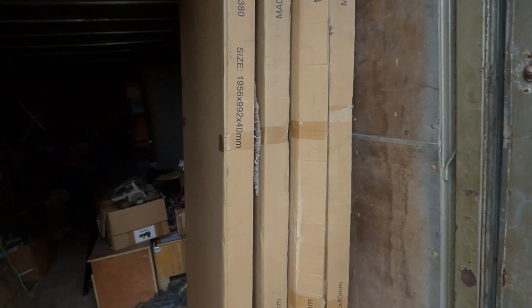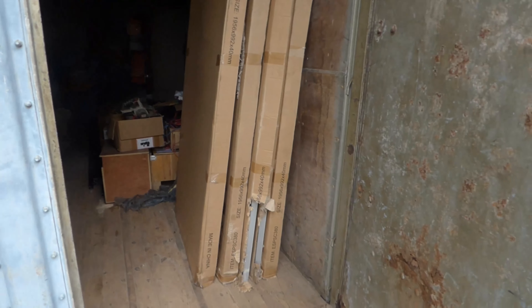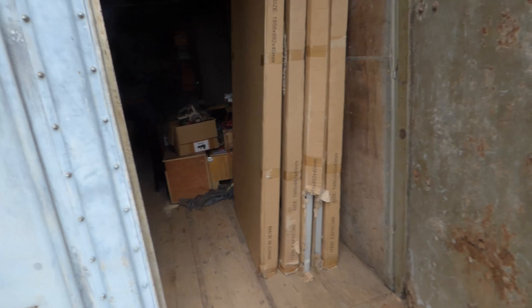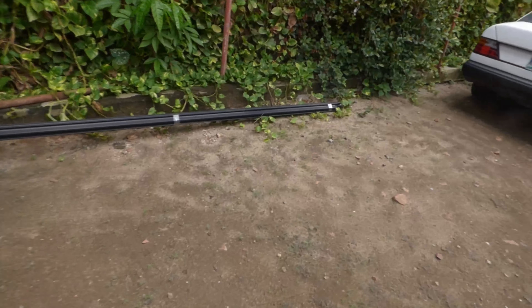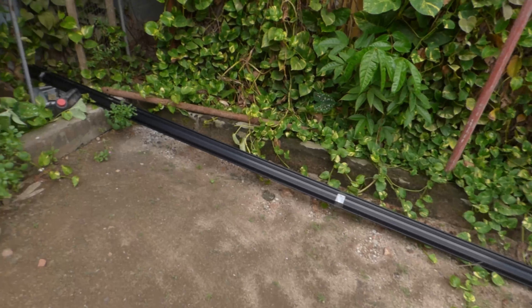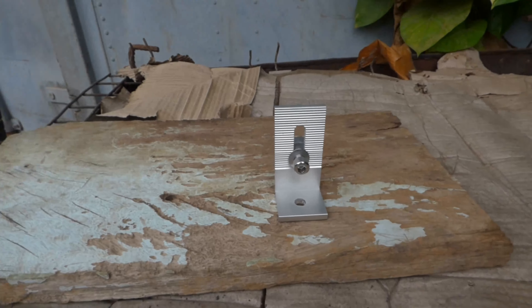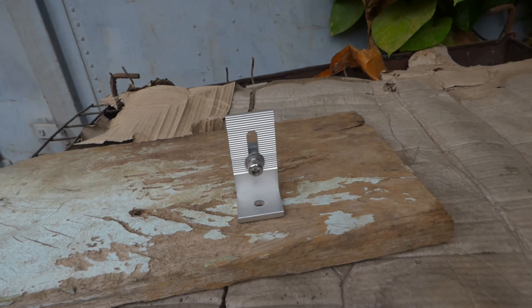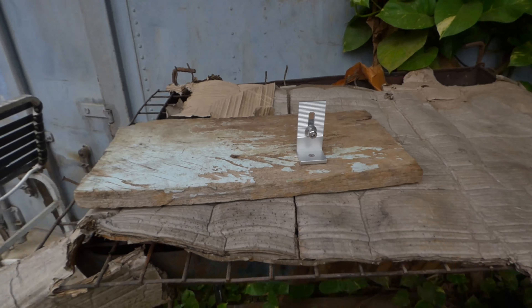These are ERA 380-watt mono standard panels — they're not half-cut panels, so I'm not going all out because it's costing quite a bit of money. I have eight of them that will be going on the roof hopefully on Monday. These are the rails, and they sit on an L-foot. The L-foot goes into the roof of the house and the rails sit right here — that's how we secure it.